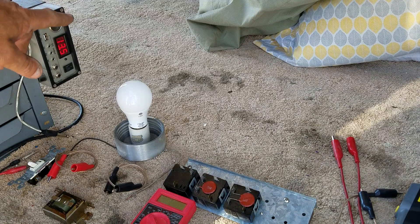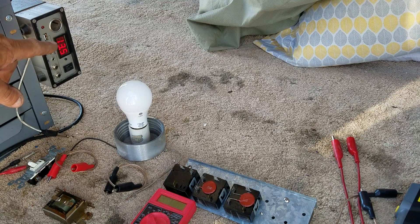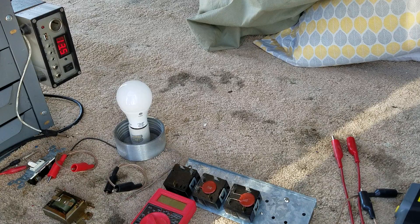As you can see on my solar charger over there, I'm getting 13.5 volts. I still haven't cleaned them. That should be up higher — probably 13.9 to 14.1 is usually what I see with good clean solar panels.